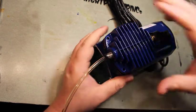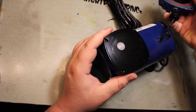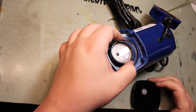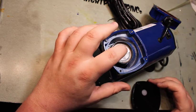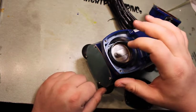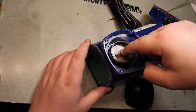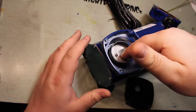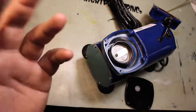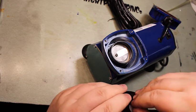This is the top of the head of this compressor. That is basically entirely how this works. When it pushes the air up, the force of the air holds this flat — the reed valve. Whenever it pushes up, it's flat, air pushes out. Whenever it pulls back down, it springs back up, lets air back into the chamber, and repeats.